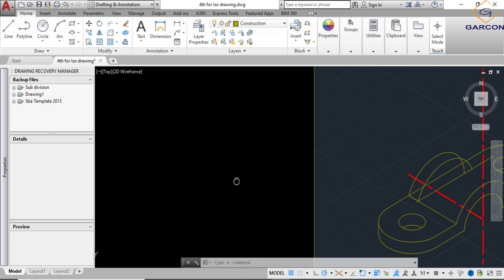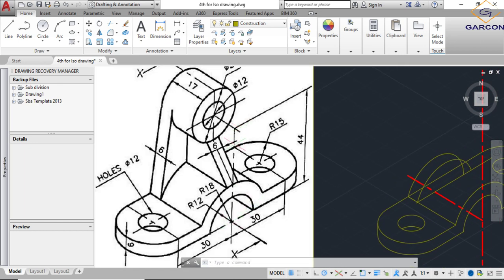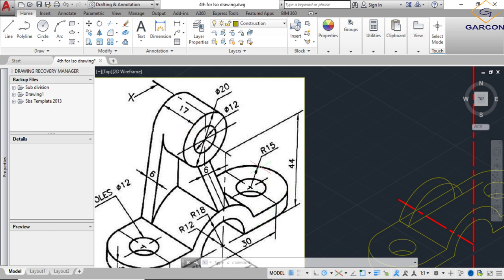What we do have is the height measurement from here to here. So we'll come all the way up here and step back to get the full measurement. We know that the full width is 30 based on the radius and diameter. So radius 15 plus 15, 30. So we understand that this is 17. So it's 17 minus 30, which leaves us 13. 2 from 15 is 13. So that leaves us 13 going from here to the center point here. So we come all the way up to 44, then go back 13, and then find that center, then start drawing this circle, then connect both of them. So that's what we'll do.